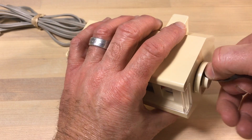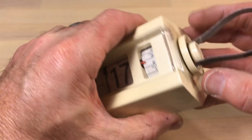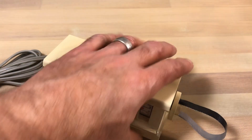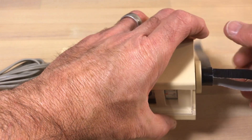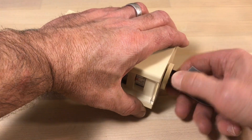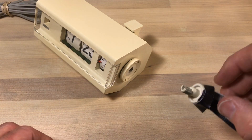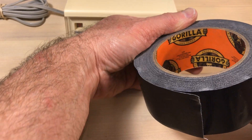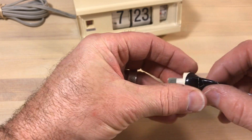What we're going to do to get these knobs off - I've already tried and they're on there tight, which to me is an indicator no one's had them off before, probably ever. So I'm using my old trick that I developed a while back: we're using tape on here. You want to avoid the temptation to grab that with a pair of pliers. Believe it or not, you get some tape on there and you can pull it right off. We're using gorilla tape - the best tape for the job.